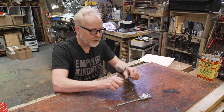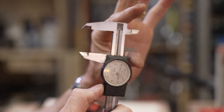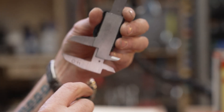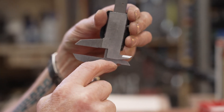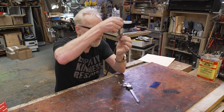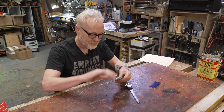Let's cover what calipers can do. They can measure in multiple different ways: the outside of something between these two jaws, which are highly ground and sharpened; the inside of things with these two jaws; the depth of things with this end piece right here. And — I know some of you are already yelling at the screen — they can also measure a step using these two pieces here. The difference between these can be measured, like a depth meter, but it allows you to measure a step really nice and square.